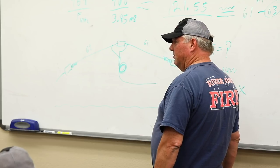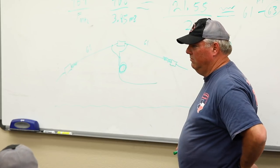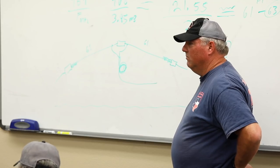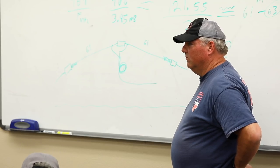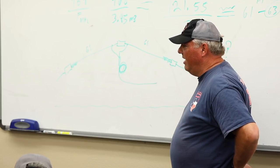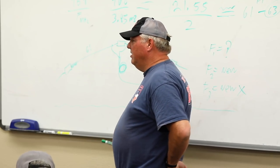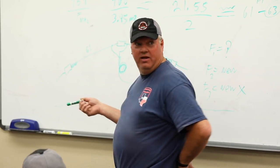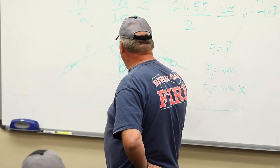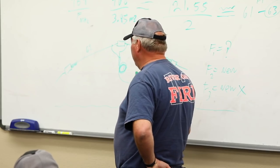So my tuner, I've got one of those I was telling you about, has the tapped tuning coil inside, in quarter-inch copper tubing, believe it or not. And it allows me to use the ladder line going out. So I'm feeding the whole thing on the ladder line. Okay. You can do that. And we're going to talk about that. You keep in mind, when you do that, you need to calculate your line length, which we're going to talk about. We're going to get to that. That's a really cool part. You want to be on half wavelength multiples. Correct. That's the next thing we're going to talk about.